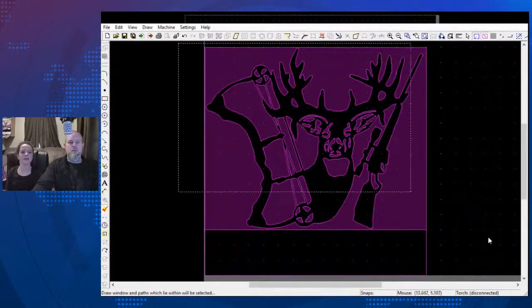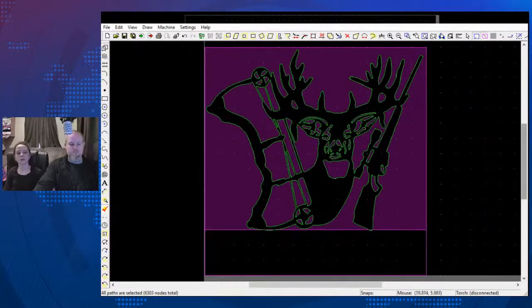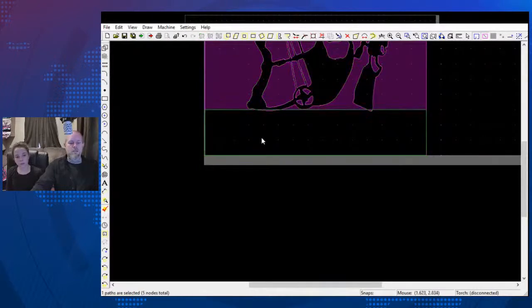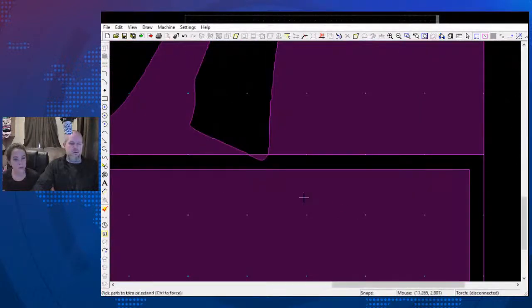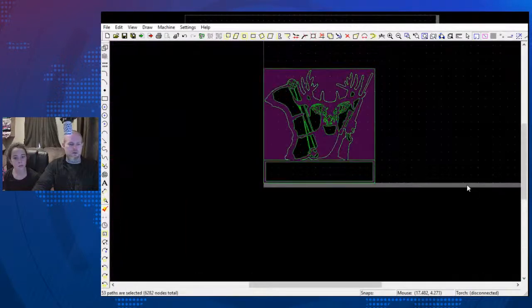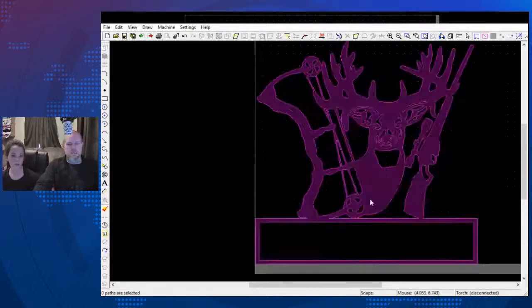Look at that. Okay. And we're going to move down like that. Let's move that down a little bit more. Okay. Now we need to offset this by 1/4 inch. So I hit O, 0.25, enter. I hit control. That copies it, but saves the old one. Now I can hit X and join that. Now we have a 15-inch sign.